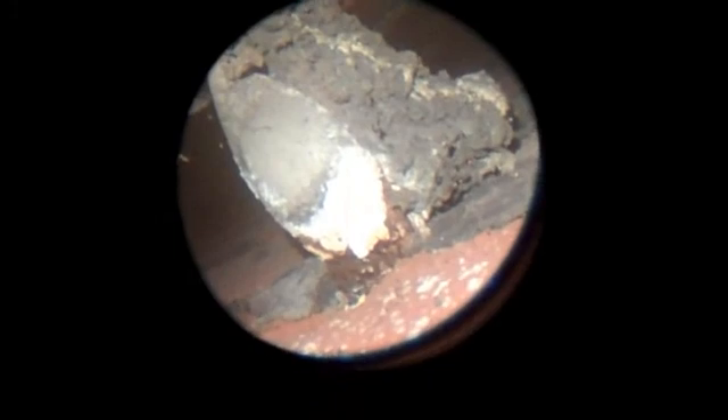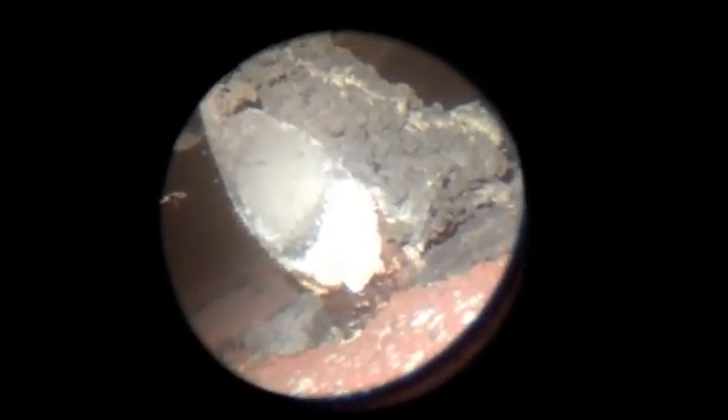You've got a very rusty tie, but actually it's well galvanised. The outer leaf — you can see the tie turns a little bit dark where the galvanising is decaying, then bright white — that's the zinc oxide — and then of course really rusty. If we look above, there's a horizontal crack in the bed joint. That's a good illustration of how black ash mortar is a cause of wall-tie corrosion and does actually worsen it by a considerable degree.